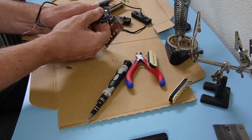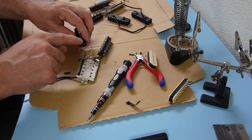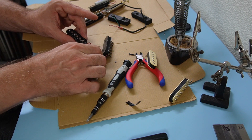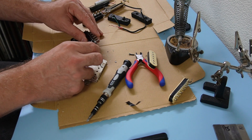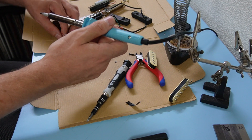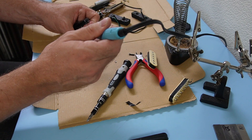Having a look at the coil — this is the side I'll be removing. The inner coil is red, the outer coil is black. To get our wiring right: on the slug side, the inner coil leads to the white lead and the outer coil leads to the black lead; on the screw side, the inner coil leads to the red lead and the outer coil leads to the green lead. To remove it, we put it under a little bit of tension and just touch it with the soldering iron — and it pops apart like that.